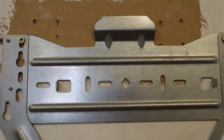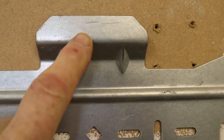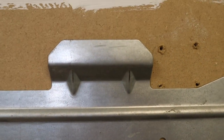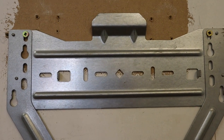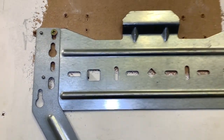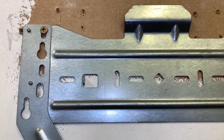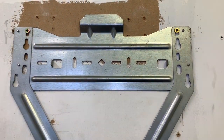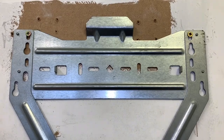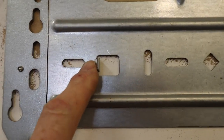At the top of the jig you can see where the boiler actually fits onto - there's a big slot in the top of the boiler casing where it slides in. They've even angled it to make it easier for hanging when it's in a cupboard. There are plenty of fixing holes, and Worcester say this jig is a simple switch with the Junior or the SI boiler using the same fixing holes.